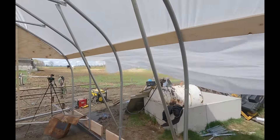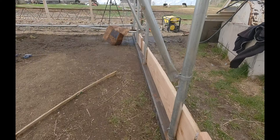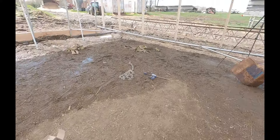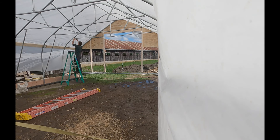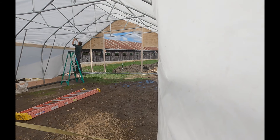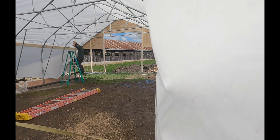These are supports we added and got from our greenhouse supplier. I'm not sure how much of a difference it makes, but it definitely seems to keep the bottom braced a little bit better as you're moving the house. We're installing them with clamps — they attach about 18 inches from the bottom of the bow and then to the bottom cord of the truss of the greenhouse.